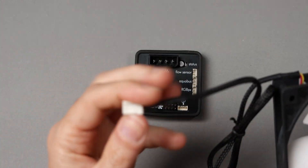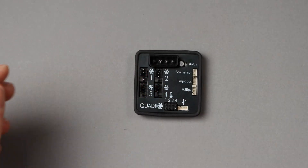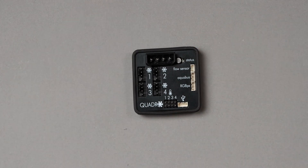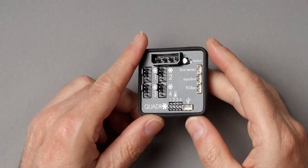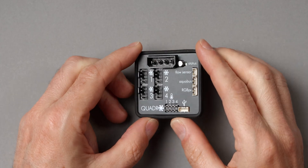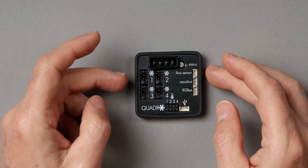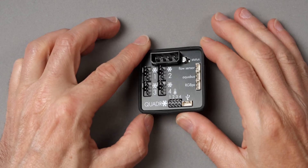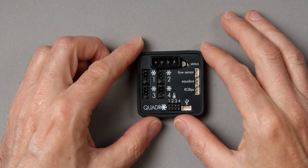Just check your fans and make sure you don't overload the controller. This fan uses 0.11 amps at full speed, so you can have a reasonable number of fans on each channel. Just remember that all fans on a channel will run at the same speed, so group your fans with that in mind. It is important that you use PWM fans — an old fan with a 3-pin connector won't work as it will constantly run at 100%. The fan connectors can also be used to control the speed of a PWM pump; however, be aware that the pump doesn't draw more than 2 amps, as some pumps use more than 2 amps at full pressure. Typically there are two connectors on a PWM pump: one PWM connector to control the speed, and another connector where the pump gets its power — typically a 4-pin Molex or SATA connector.